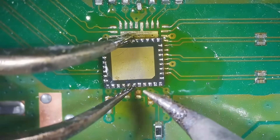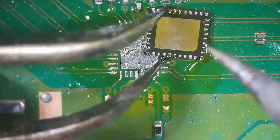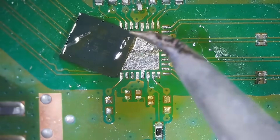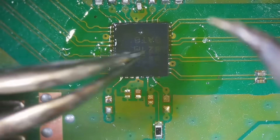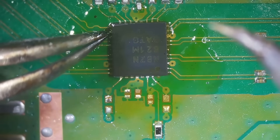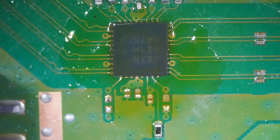That's not too bad. Now we just need to prep this chip. I soaked it in flux and I'm going to come through with some solder on my iron and put a little bit on each of those pads — it's called tinning the chip, tinning the pads. That'll help it stick to the board once I get ready to install it. I usually don't tin the pads right on the board like this, but I'm already set up with my microscope so it's just easier for now.